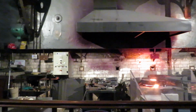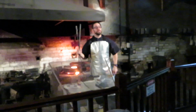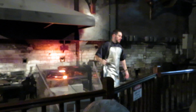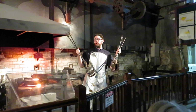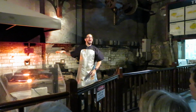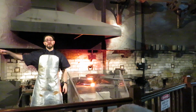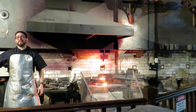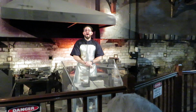That's pretty easy. This bar is heavily reinforced, giving me more leverage so I can slowly and carefully pour the gold. I'll do my very best not to spill it. Then the empty crucible goes back into the furnace out of my way, and at that point, the really hot stuff is already done. So I'll take off the big gloves and the visor. I'll swap to basic leather gloves just to protect my hands. Grab my tray here, and by now we are 1 minute in.